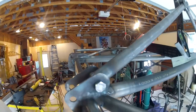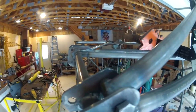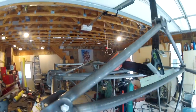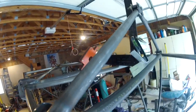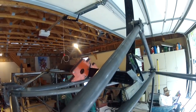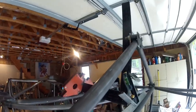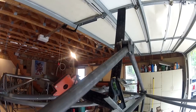Alright, so the strut is welded. It's welded to the bushings. I put everything back together. I had to heat this cherry red and torque it just a little bit to get everything to line up again because the welding made the part warp. So it's cooling, and once it's cool, I'll tack the mount plate into place. I need to shim that up a little bit so that those bushings have some relief from the V-strut, because those parts will move. That's where the shock struts will attach to. So I'll shim that, tack it into position, and then I'm done.